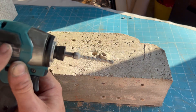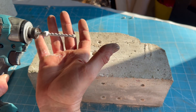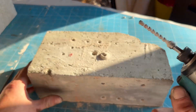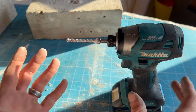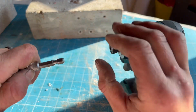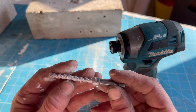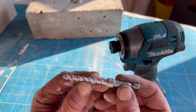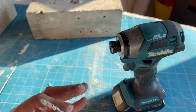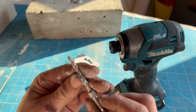But this little new Armeg bit - it was amazing on the blockwork and I presume if it's kind of softer brick it'll still be pretty good. I was asking a bit too much thinking I could drill into really dense concrete. Overall, I'm not totally sure about it. I managed to get the bit out - it's loosened off a little bit. It wouldn't go in the drill but I think that was just a casting blip. The way it went into the quite dense concrete block was impressive. So if you see them knocking about, the Armeg Twister impact masonry bit - check them out.